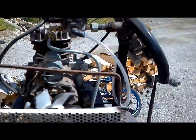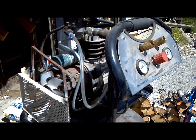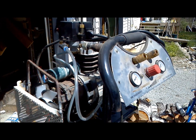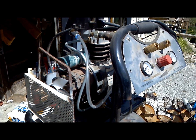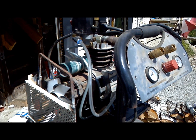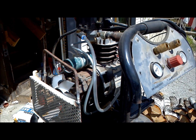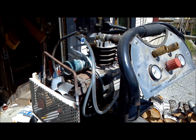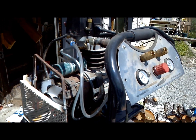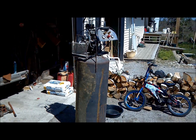And there you have it. It'll do the full 160 PSI without any issue. It takes probably a 5 to 10 minute charge before it'll hit 120. You can operate a paint gun consistently for about 2 hours straight without even thinking. If you need something that's going to draw 120 PSI consistently — like a large impact wrench drawing 80 PSI — you can work through quite a bit before it has to recharge. It'll on-demand about 60 without any issue, and at 40 it doesn't even flinch. And that's how to make a 40-gallon air compressor. Have a good day.